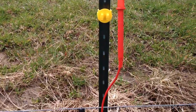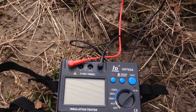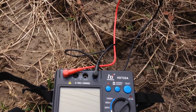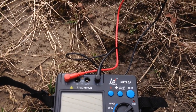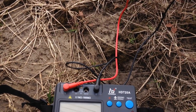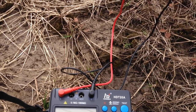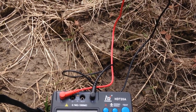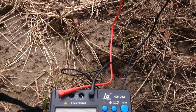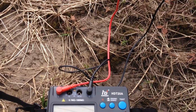I've clipped up and I'm testing it. I wanted to share that with you because that is another way to test your fence with a piece of test equipment you could use for something else. I'm going to do some work in the fence line, leave the fencer turned off until I leave, by which time it will have recovered, because it consumes very, very little power — as long as there isn't a short on the line.